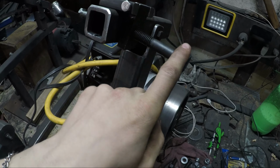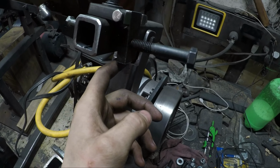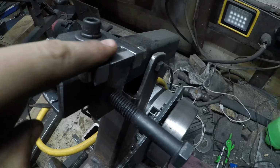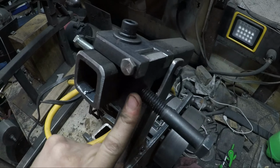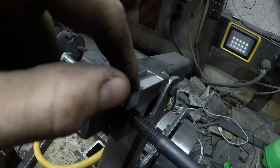I even went out and bought bearings just to make my own wheels, especially because it gives me good experience too, right? Just took this piece, and because this is 2 inches, this is 1 inch. Once I put the quarter inch hole through both of these pieces, ground down the corner so that this couldn't pivot, and then also cut out and then hand filed in this part.